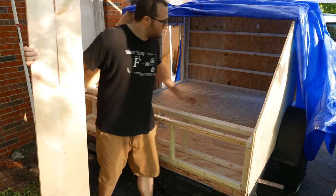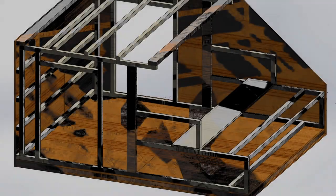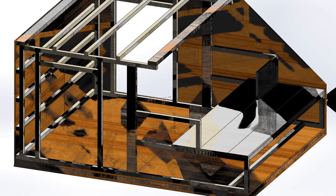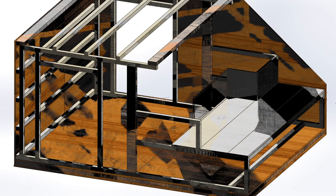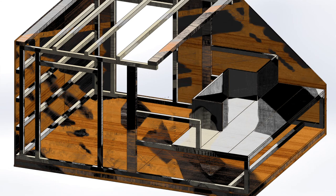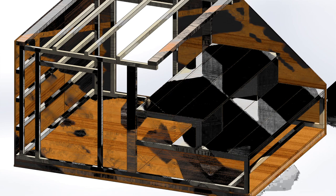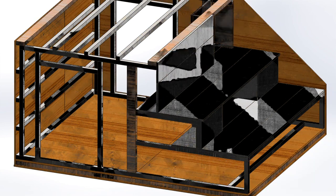The next thing to build is the shelving. The galley will be built a hundred percent out of 1 by 12 boards cut to size. The boards will be screwed together in an overlapping manner that will make them structurally rigid both horizontally and vertically. This eliminates the need for additional structural boards, thus reducing cost and eliminating weight.